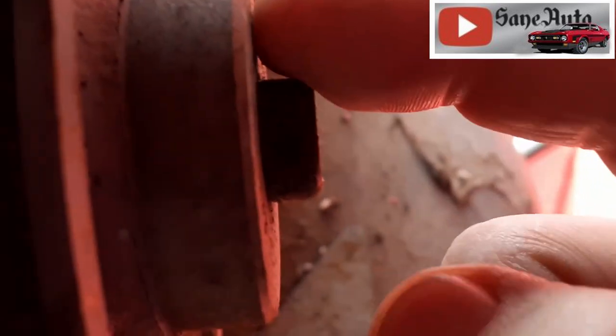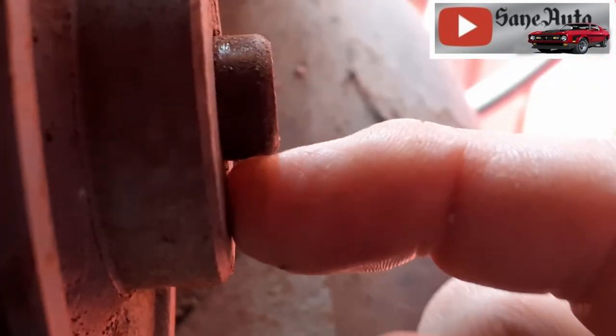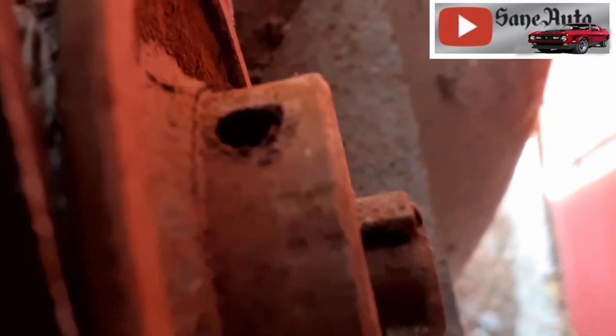And then when I come back, I use the wire wheel and polish this off as much as I can. And there will always be a lock here somewhere. Okay, right there it is. Let's turn it here, see if you can see it. Right there. You usually have to use an Allen to unscrew that. And once you get that out, if you turn that up and spray it with the PB Blaster or WD-40 as well, and then put a little transmission fluid on it, that also helps.